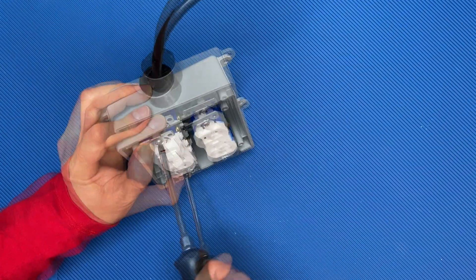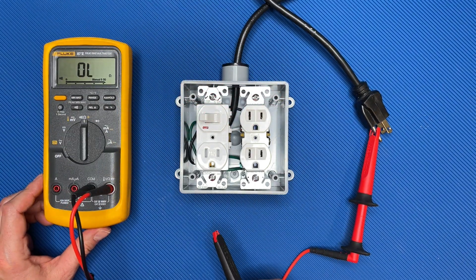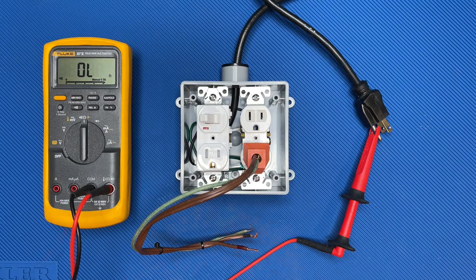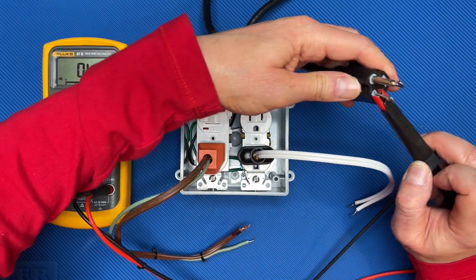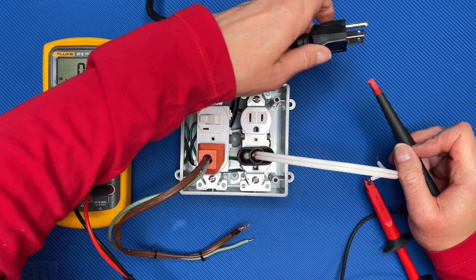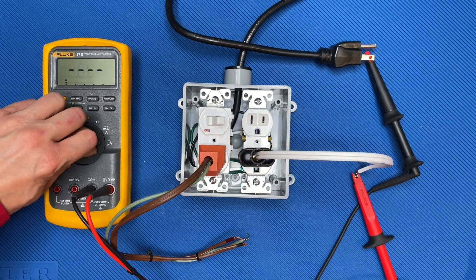Now that the wiring is done, screw the switched outlet and the dual outlet securely to the box. You can leave the cover plate off for now. Let's double-check our wiring with some continuity tests. Put your multimeter into continuity mode and attach one test lead to the ground terminal of the power cord's plug, and make sure you have continuity to the metal housing of the switched outlet and to the dual outlet. Now insert a 3-wire plug into one of the dual outlets and make sure you have continuity between the power cord's ground and the outlet ground. Now put either a 2- or 3-wire plug into the switched outlet and short the neutral and hot. Plug another plug into one of the dual outlets, connect one test lead to the neutral prong of the power cord, and make sure there's continuity to the neutral side of the dual outlet plug — whether the switch is on or off. Now connect one test lead to the hot prong of the power cord and make sure there's continuity to the hot side of the dual outlet plug, but only when the switch is in the on position. Also make sure there's only continuity when the switch is on and the switched outlet is shorted. If your current limiter doesn't pass these tests, don't power it up until it does.